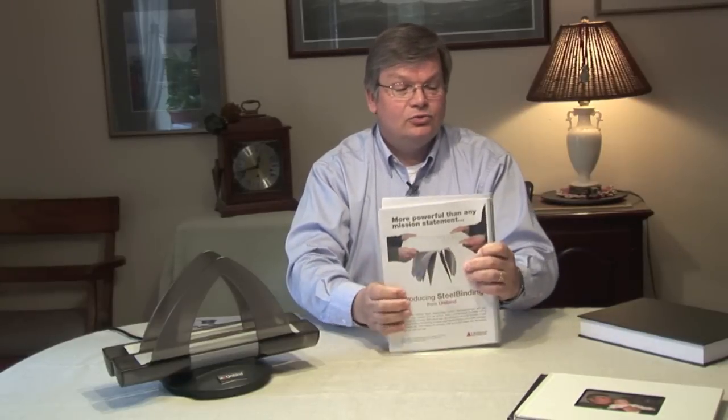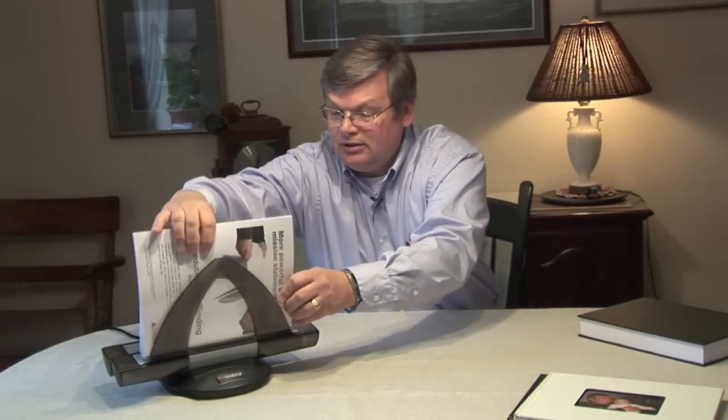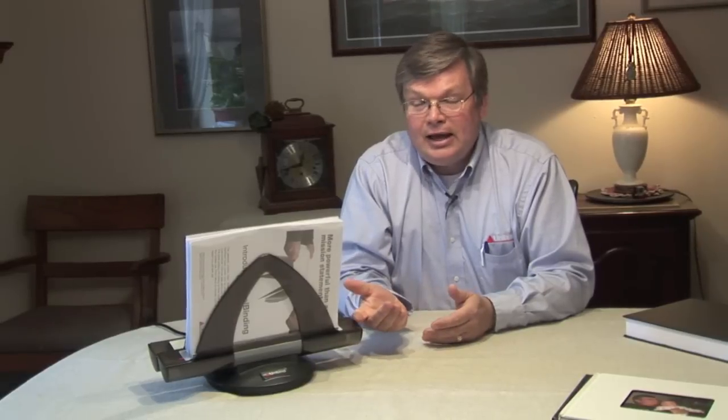The unique thing is we can do several at a time. I'm going to do five on this machine in a two-minute time frame. I don't turn the machine on — the machine turns on itself. The spine actually has a steel shank in it, and then the magnet in the machine turns the machine on when we put product in the heat plate. That will now go on for 90 seconds to complete the binding process.